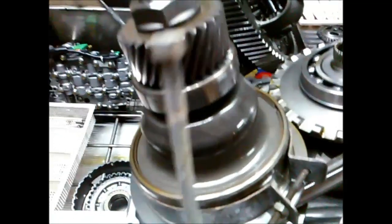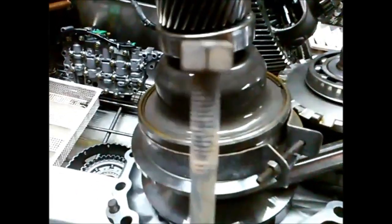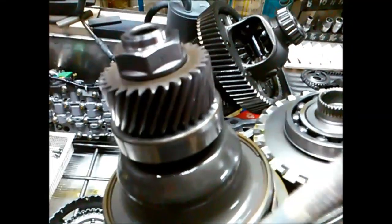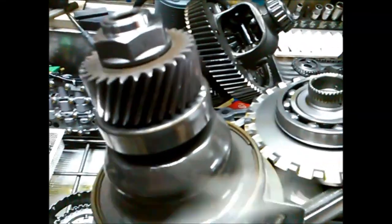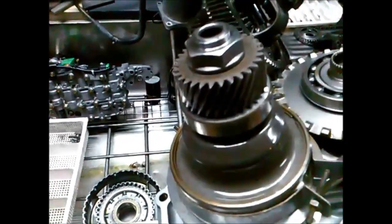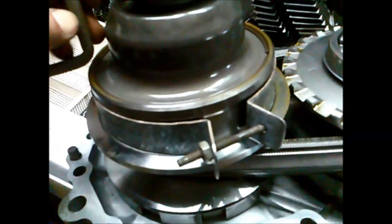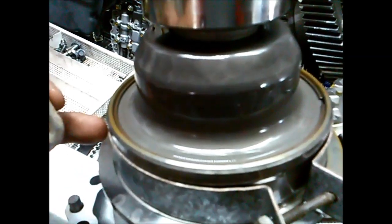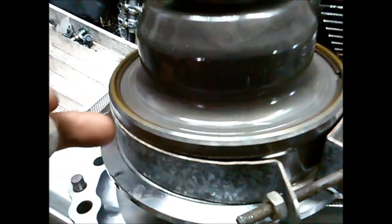What I'm actually going to do is straighten that out and just weld it there so I've got a little bit of adjustment at the top. Then there'll just be a flat rod that goes across and I can put a threaded plate in there so I can pull it out. I'm going to bend a little step there just so it's closer to the centre of the drum, and so that bit can actually lean on there — just so it's pulling that top edge up against that step.